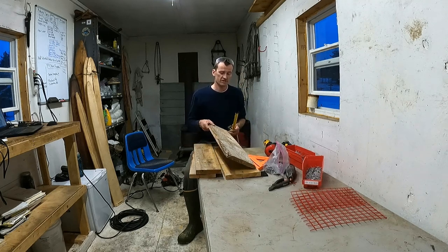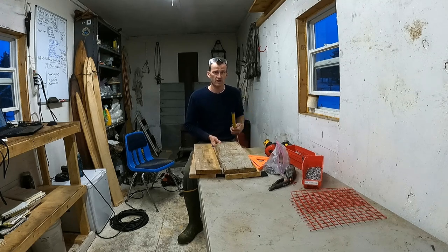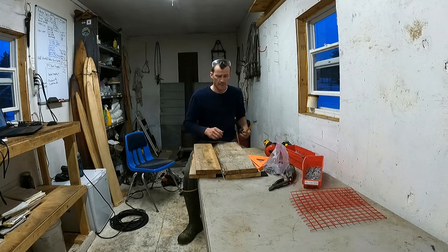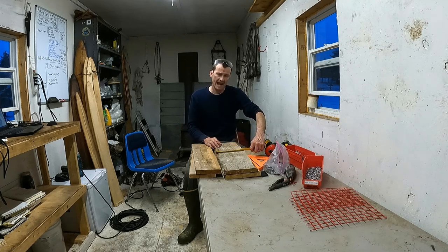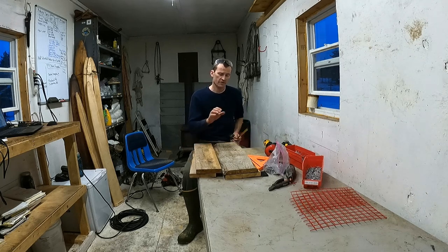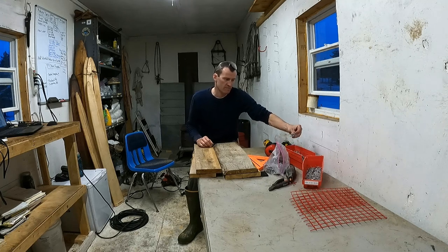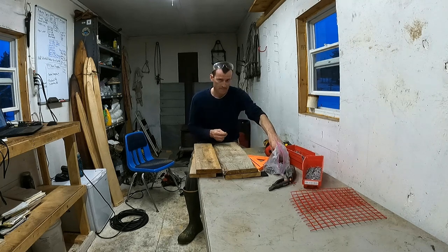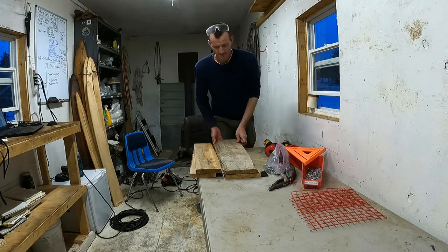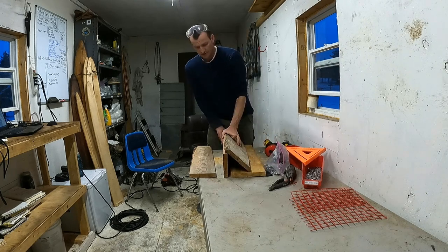We're going to start with four pieces of wood, approximately one inch to one inch three-quarters thick. I like one inch because you get a little more to work with. You could use particle board or plywood at three-quarter inch thick, but I wouldn't really recommend it and it's really expensive right now. I have two different sizes: 30 inches long and 8 inches wide for the wide ones, and 6 inches wide for the narrow ones — so 30 by 8 and 30 by 6, two of each. We've got inch-and-a-half screws. The top and bottom will be the wide pieces and the sides will be the narrow pieces.